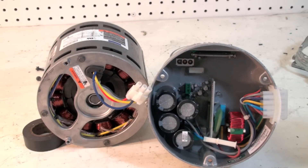That's kind of a nutshell explanation of these things — there's a lot more to them and I will talk about them in future videos. But from a troubleshooting point of view, if it fails to work, chances are this end bell has failed. Most distributors have a tester for this — we actually have one at my company. You can't test the Emerson but you can test the GE. However, I've found it just as well to go down to the distributor and have him test it, otherwise you're going in a little bit blind.